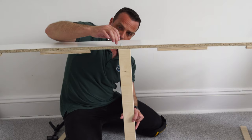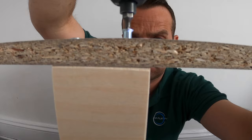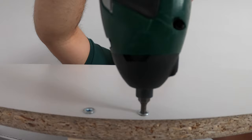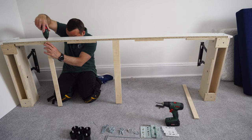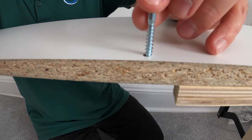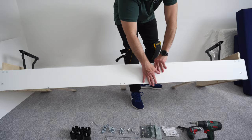Place two of them — we have a small allen key there as well. Place the screws and secure from the top. Just when you feel enough resistance, stop. That's the support for the bottom panel in the storage. Those small panels around are going to hold the storage and this is the middle support for the storage at the bottom. One screw on each side and two screws on the middle support. Now we can put it down this way. Be careful because those three slim supports on the middle are fragile, so just lift it up slowly.